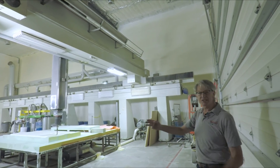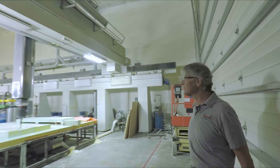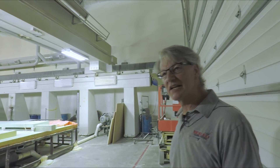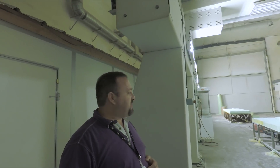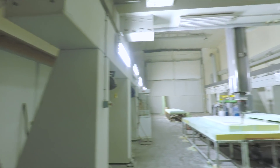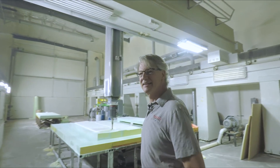It's a 50 feet by 20 feet by 8 feet milling area. We typically run about 1,400 inches a minute on feed, and rapid we run to 2,000 inches a minute — it's pretty quick. When you first said 50 by 20, I kind of thought it wasn't that much bigger than my Haas — you mean feet, not inches.